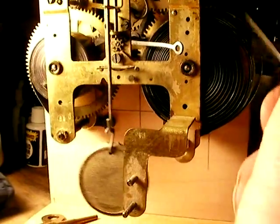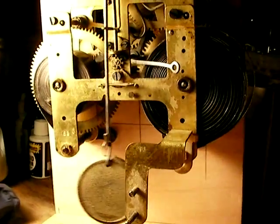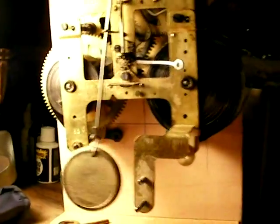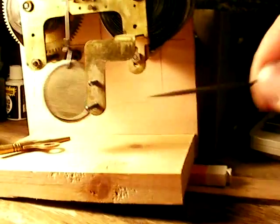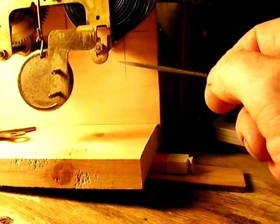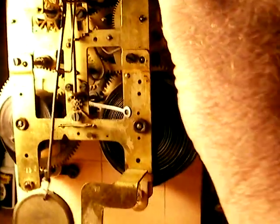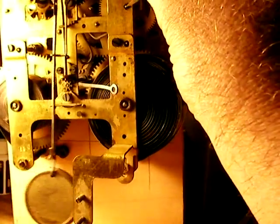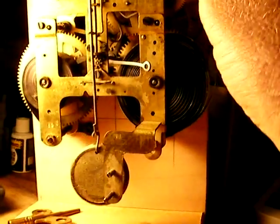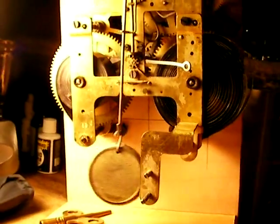I want to relax the spring so it has gaps in it. When I put this in the ultrasonic cleaner — it was mainly designed for surgical instruments — I'm going to use a water-based degreaser to get in between the coils of the main spring. I've got it lifted on one end; the mechanism works when lifted but stops when I bring it to level. I'm planning to use a toothbrush on the outside, blast some carb cleaner through it, then the ultrasonic will break everything loose. Then I'm hoping to squeeze in some tri-flow grease and tri-flow oil carefully.